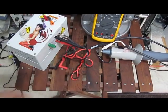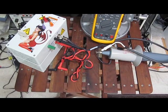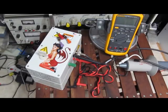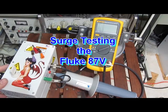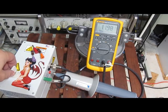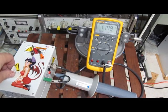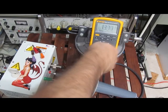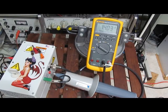Okay. We're looking for any kind of a discharge here. If the probes do break down, we should see a change in the signature of that waveform. Again, no change in the waveform. Same transient that we supplied to the 101. Run through all the same modes. Again, we won't test the current input. This is with a basically 100 millisecond wide, 13 kV pulse, a little bit of DC bias on it.